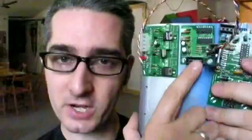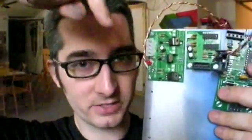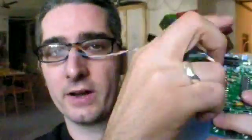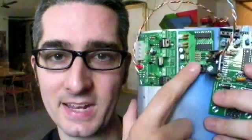These are the circuit boards you're gonna need for your RepRap project. We're gonna start with a motor controller board. This controls the motor at the top of the extruder that pushes plastic down to the heating element. Now, this can actually drive two motors, but we're just gonna use it for one. This is where power goes. This wire is where you hook it up to the Arduino, and we've got some little clips here where you can just plug in your motors. Let's get started putting this together and then testing it out.